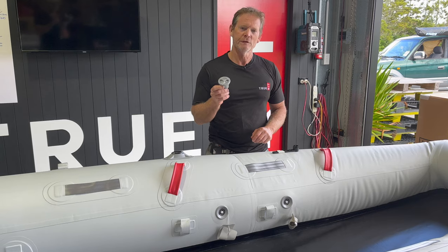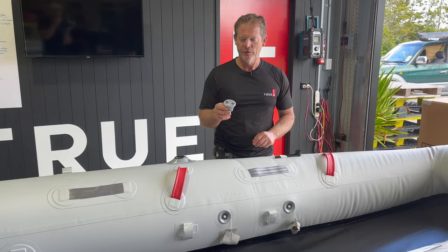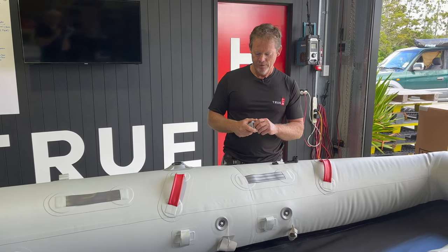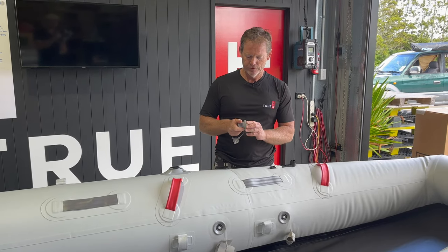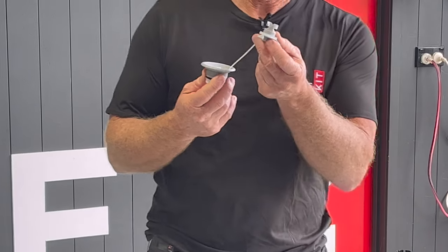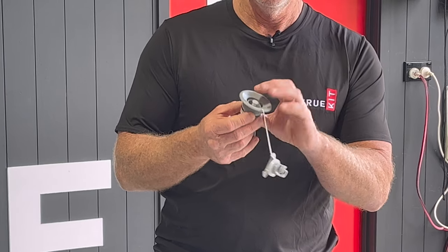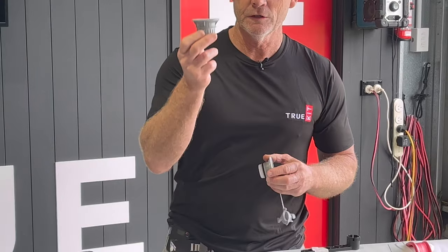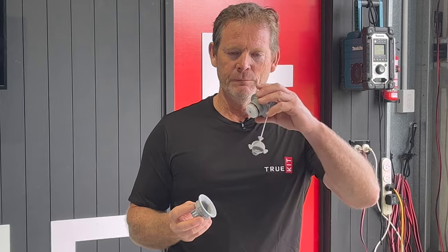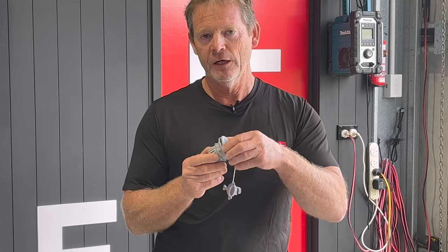This is one of the inflatable boat valves that we use. It's called a Bravo valve, which is the one that we like. We think it's the best on the market, but there are several others that all operate in a similar way. An inflatable boat valve has several components. The main one you can see is the top part, which consists of a dust cap screwed in to keep the dust out, the main valve body, and then the bit that you never see because it's on the inside of the tube, which we call the basket. The top part actually screws into the basket and clamps around the fabric to create an airtight seal.